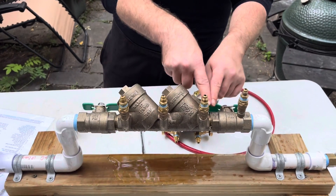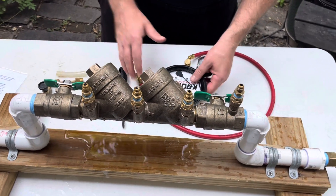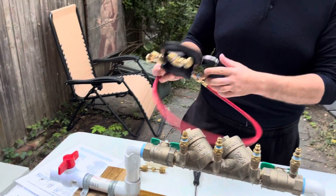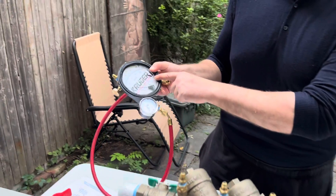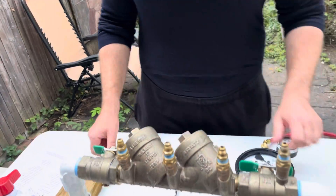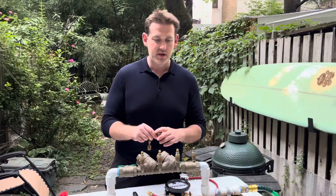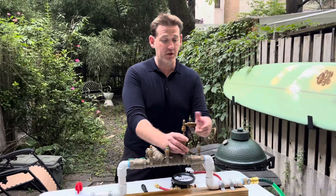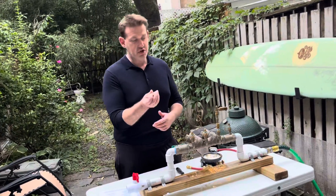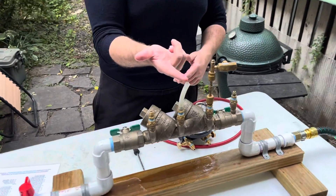It's all fittings to test cocks — these already have the fittings, they're quarter-by-flare; some of the larger ones might be different. Close all needle valves on your test kit — for us we just have two: the high and low needle valve, marked on the gauge. High side is the left side. Close those. You have a bleed-off valve arrangement in case a shutoff leaks. For USC they say to put it on no matter what, so put your bleed-off arrangement on test cock two.